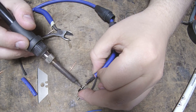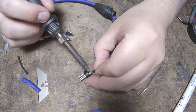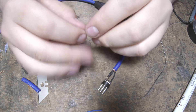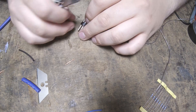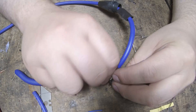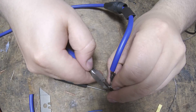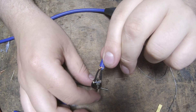Now we can finally attach the cable to the connector by melting the solder on the pins and pushing the resistors and shields into them. The resistors should be connected to pin 2 and the shield goes to pin 1 — the XLR connector should have the pin numbers printed onto the plastic beside each pin. We also need a third resistor to act as the input ground impedance; this resistor goes between pins 1 and 2 and should be a quarter-watt 20k ohm resistor. Pins 1 and 3 should also be connected together, since we're connecting an unbalanced signal into a balanced input and the cold signal should be tied to ground in that case. We'll use the extra length of wire on one of the legs of the resistor to achieve this. Place the resistor below pins 1 and 2, wrap one leg round pin 2 and wrap the other leg round pin 3, making sure it comes into contact with pin 1 — I've drawn a diagram that will hopefully explain it.